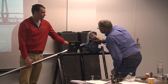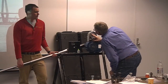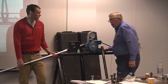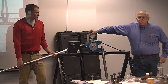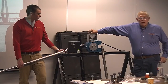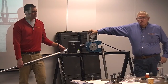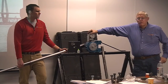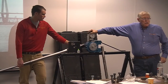So we're at, just a second here, 2, 4, 7. At 50 kips, we got one open. So typically, at proper installation, we're at about 49, 50 kips. If we'd have 2 open, we'd be at about 49 kips. So that's what would be the maximum. We'd expect 49 kips on this DTI with 2 open. We got 1 open and we're at 50, or just over 50, about 51, not quite 51. So that would be the tension you're getting out of this DTI, okay?